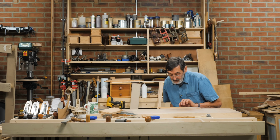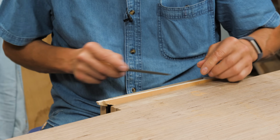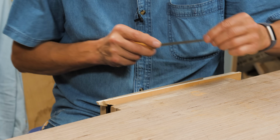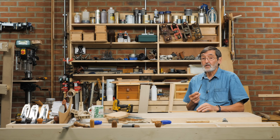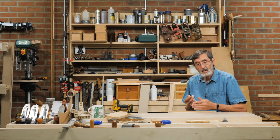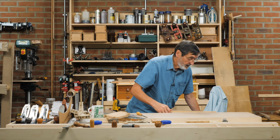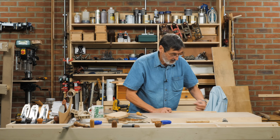And then I'll look back to see if I did miss any. There's 1. And there's 1. So I've sharpened it all from one side, and that means the burr, if there is a burr from the roughness of the file, will be on one side. But as soon as I use the saw, it will break off and the saw will cut beautifully.